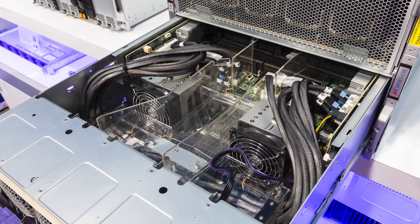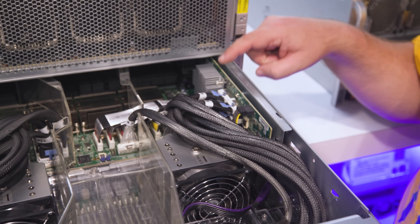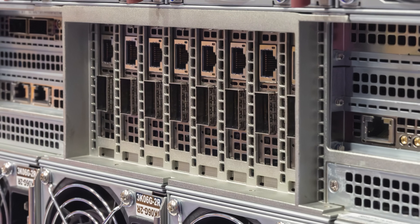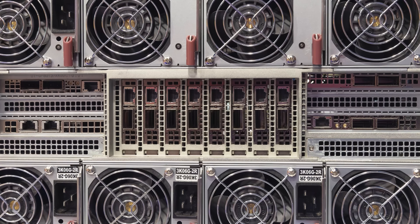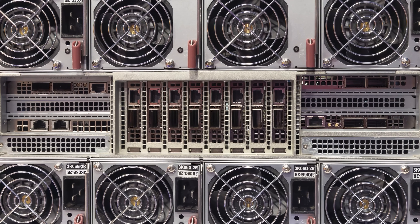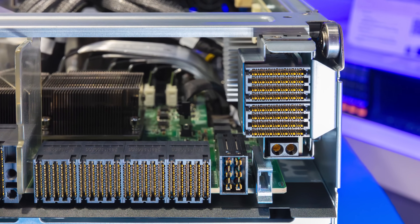The NIC layout actually mirrors the PCIe switch architecture inside. The eight NVIDIA Bluefield 3 Super NICs in the center align to the four-switch Broadcom PCIe switch board, while the Bluefield 3 DPUs on each side are plugged into the CPU side for north-south traffic and align to the PCIe switch boards on the sides of the chassis.